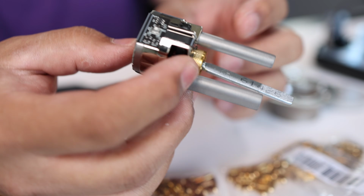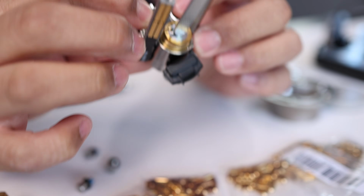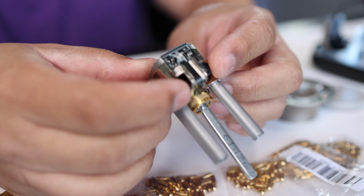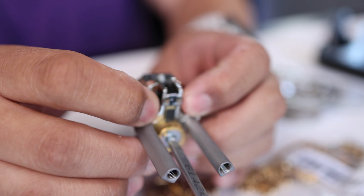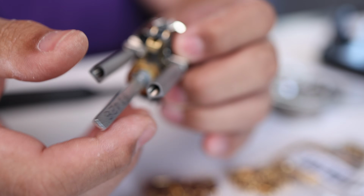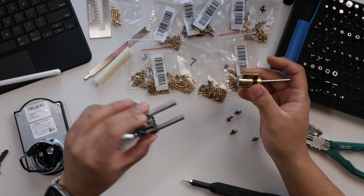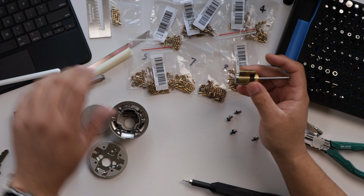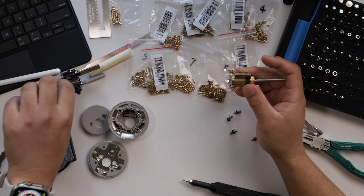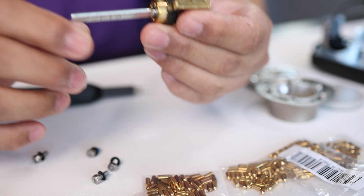So I'm going to place my fingers here where these Torx bits are, and I'm going to push the cylinder forward or back into itself. If you can see, there's a little piece there that's going to push forward. Just let it go ahead and push out of there, and it'll move out of the way. And there you have the cylinder, so we can go ahead and rekey this as well. And place the electronics aside in a safe place. Make sure none of these things get disconnected. And there's the cylinder for the Level Lock Plus to rekey.